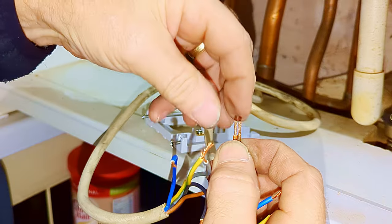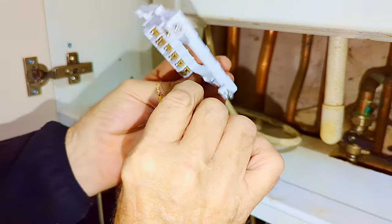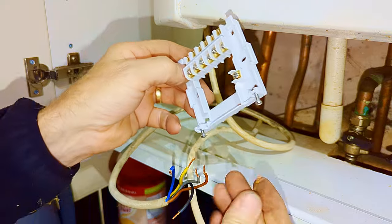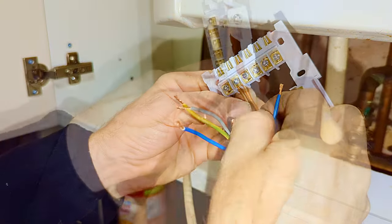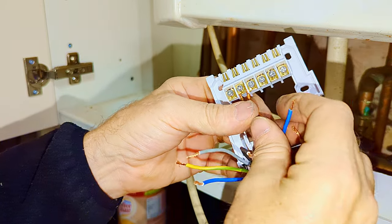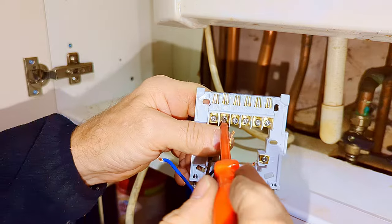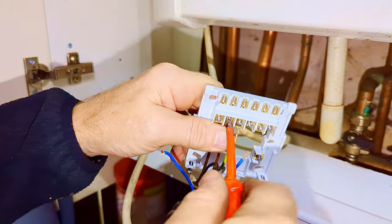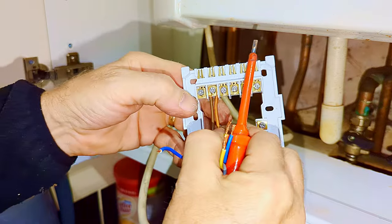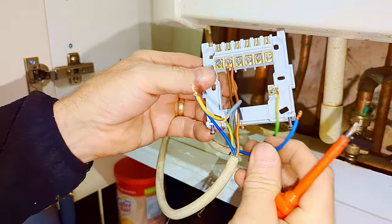So now I've got my two live wires — that's power coming in and power being taken up to the boiler. Here's a little tip: if you turn it upside down and give it a little shake, the plate drops down and it's much easier to insert the wire. This can be a little fiddly and you definitely need three hands, but you can see here I'm holding the plate and also holding the two wires, then do up the screw keeping the wires in place until the screw is nice and tight.